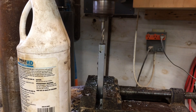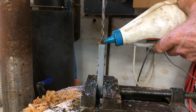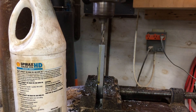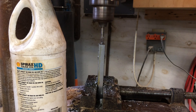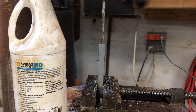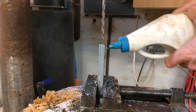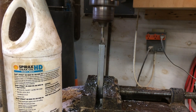Surprisingly they drilled pretty easily. I attribute that to getting a good vice to hold them steady and vertical, and also that he already had an inch drilled so it kept the drill bit going straight. I used a brand new drill bit and ended up drilling them just a tad more than halfway through, so when I flipped them over I could get them all the way through. I'm grateful because that makes setting the wires much easier.